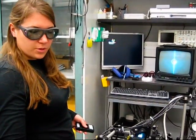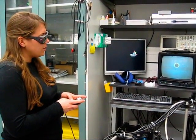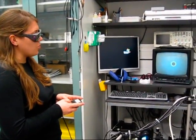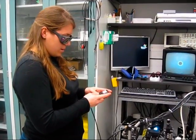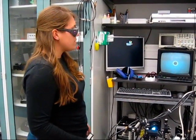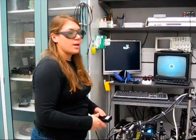If I put this filter in front of the camera, it cuts off light with longer wavelengths than about 1050 nanometers. So I can block the trap, and I can move the trap around in the focal plane with my motorized controls. I can also move it in the axial direction, but you can't really tell. So this allows us to manipulate objects, and we can also collect the forward-scattered laser light onto a position-sensing detector and watch its motion in the x and y direction.